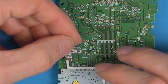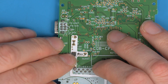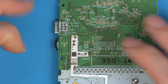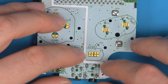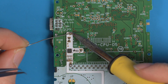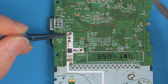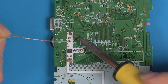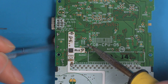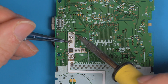Then place the Clean Amp Pro over the pads and they will align up perfectly. If you align those up, you'll see a nice perfect alignment. Down here you can just solder that one to hold it in place. With them on, let's start with this one — a bit of extra solder, get the tweezers and just hold the board down — then the same for the others, blob solder over. If you're unsure, just hold the board down when you're doing it and you know you're going to get a good connection.